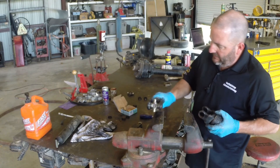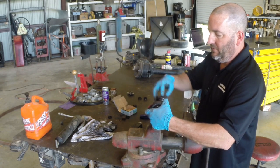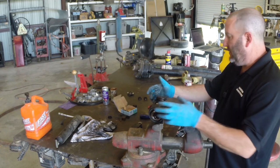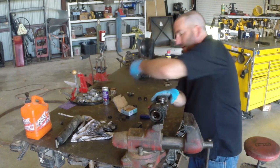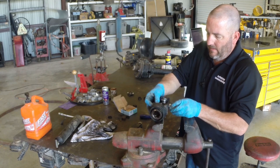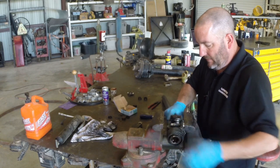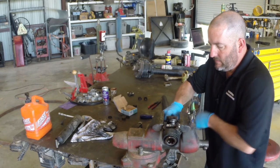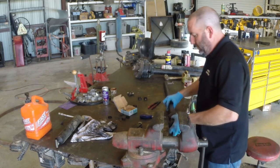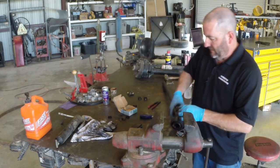I've got to find my X that I made earlier — there's my X right there on this one, and an X on this one, so this guy goes on like this so both my X's are up. This is back in the same way it was when we took it apart, so if it didn't vibrate before it shouldn't vibrate now. I'm going to get one of my cups started over here and once I'm happy that it started, we can use the vise to press it in.